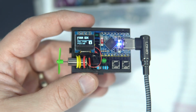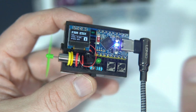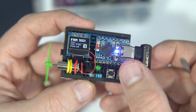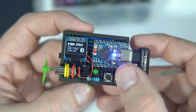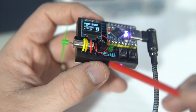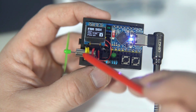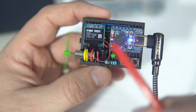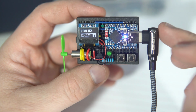Here I have this motor. So basically, using pulse width modulation, I can set spinning speed of this motor. Here I have transistor, diode and resistor. All three components are used to act as a switch for this DC motor, because it is not wise to drive motors directly from development boards, because they need lots of current.